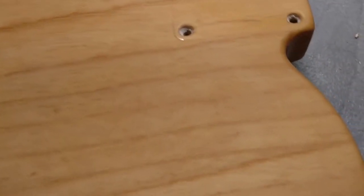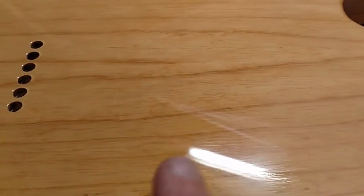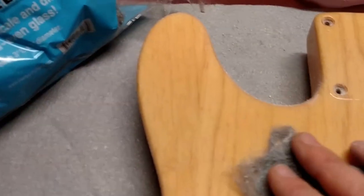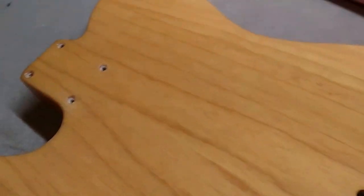About five minutes in and you can already see quite a bit of progress — all by hand using extra fine steel wool. You can see right there where the shine of the finish still is, and over here it's gone. It's really looking the way I was hoping. While I'm doing this I'm wearing face protection — just a bandana — because there's definitely dust kicking up. You don't want to be breathing that, so wear a proper face mask or bandana.